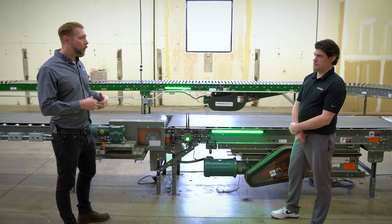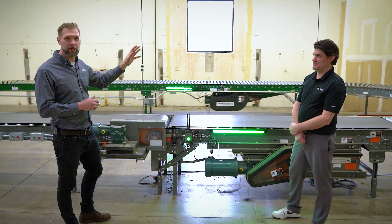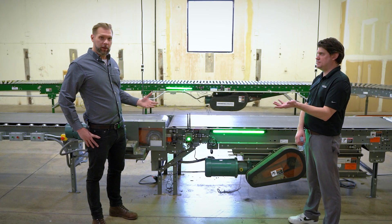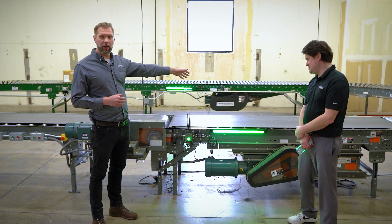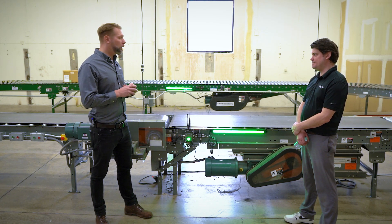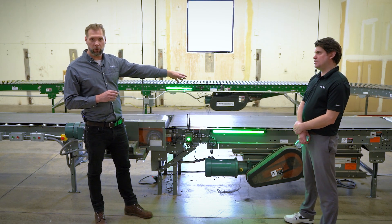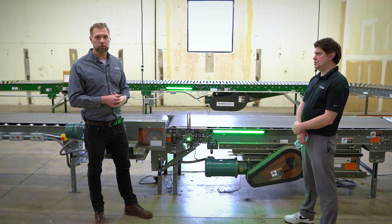But what happens when something is too far away or there isn't any power available? We can use a battery — and that's what we're doing even further down the conveyor. We're using a wireless performance node, the CM1L, which takes inputs from a current sensor as well as a vibration sensor — the exact same job. We're making pockets of data islands and bringing them all back to the controller using several networks. We're using a performance wireless network over there, and if it were multi-hop, we can absolutely do that too — we can throw a multi-hop radio inside this controller and stretch across your entire plant using repeaters. So we're doing wire replacement with the R70 nodes and wired monitoring right at the controller, plus the performance network using batteries for places without readily available power.